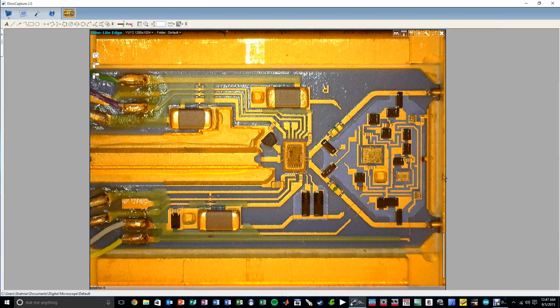And here we have the probe directly under the microscope, and there's a lot that we can see going on here. Obviously the input biasing, the DC input biasing of the whole front-end amplifier is provided with these signals right here. Now these signals are going to be responsible for setting the DC common mode input voltage range, as well as the voltage that appears at the input of the probe in order to compensate for single-ended measurements and so on, so you can cancel any DC bias that you have on your lines, on your buses that you're trying to measure. So you can see some big decoupling caps, big compared to everything else of course, and you can even see one decoupling cap here which seems to be paired with a resistor and another parallel capacitor, perhaps to damp it further or to create the necessary time constant.